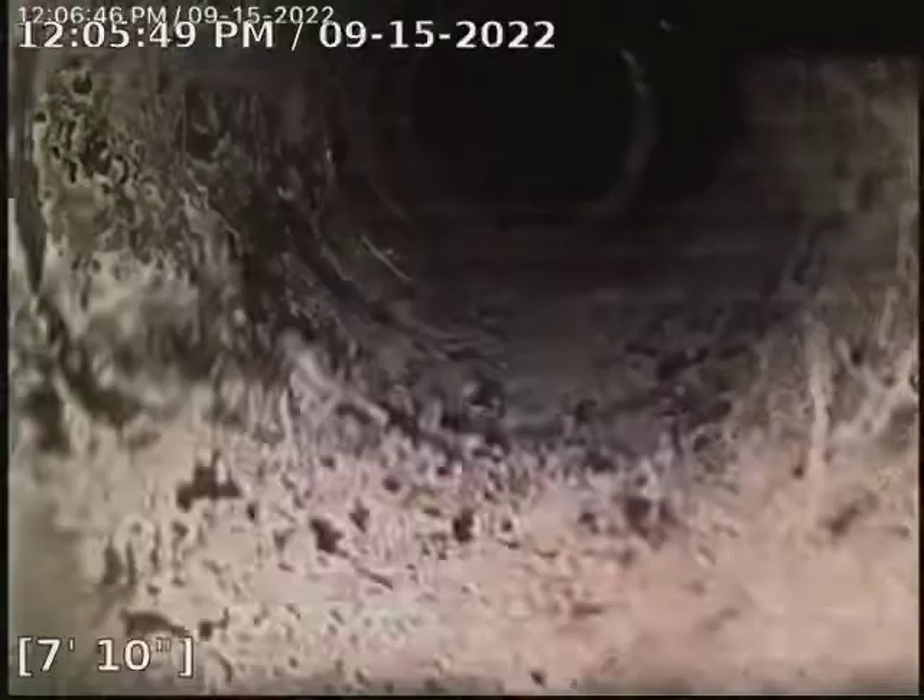Here shortly we are going to be coming out to the transition from cast iron to plastic. There's a pretty good offset there. There's a little bit of black sludge there though. As soon as we get there I'll explain more what's going on. Right there — the transition. You can see the bottom of the cast iron pipe to your right. It looks like little roots growing in; I'm not sure. Can't tell looking at it on my phone, but we're bringing it back to the shop to look at it on the big screen and identify from there.